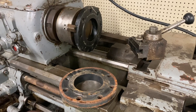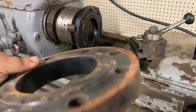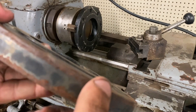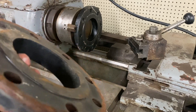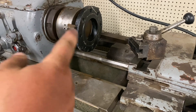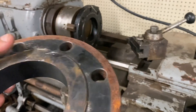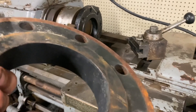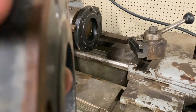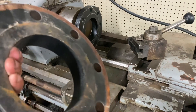Hi, this is Adam with Small Town Machine Shop. A quick little machining job today that came in — a farmer wants me to take two of these raised face flanges and machine down this face to leave more room between them. If you're not familiar, the other one is exactly the same. These raised faces are where the gasket sits — in this case it's going to get a green Garlock gasket, because I'm not a fan of red ring gaskets. That spaces it off when the two flanges meet, focused by this distance, so it's easier to get wedges and stuff in there.